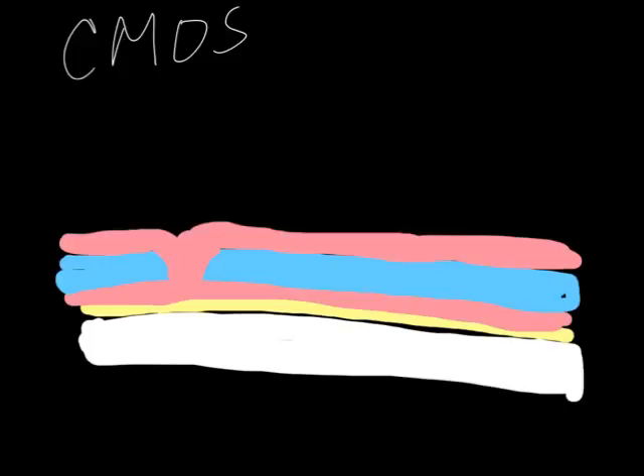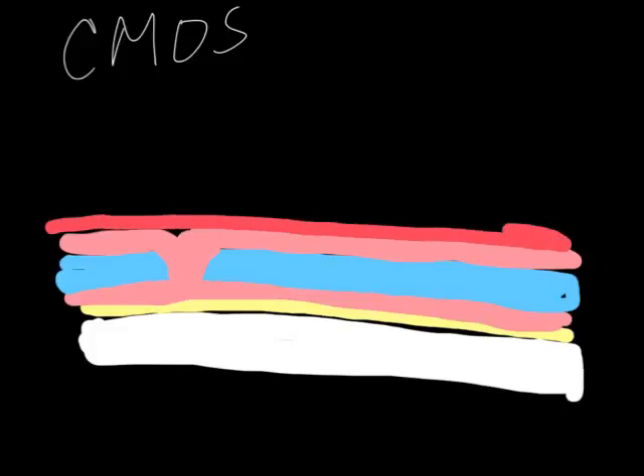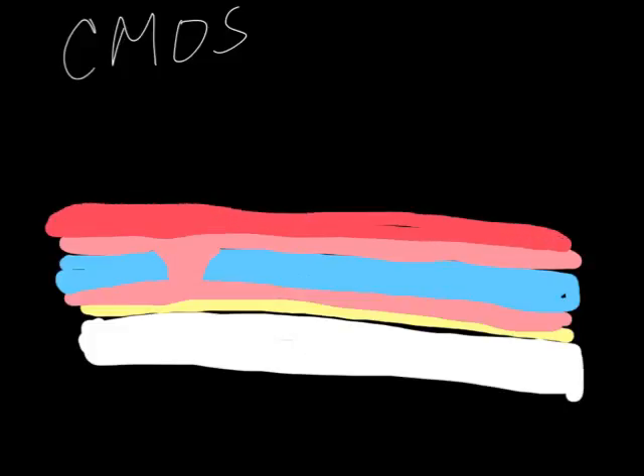So I just connected one polycrystalline silicon layer to another. I can pattern this thing. So we'll make the photoresist bright red — we throw some photoresist on here. If you took intro to MEMS, you've done some patterning. Then we make a pattern and etch some holes in it if we want to. If we put a pattern on it and get rid of the photoresist where we don't want it, we're left with this photoresist here.